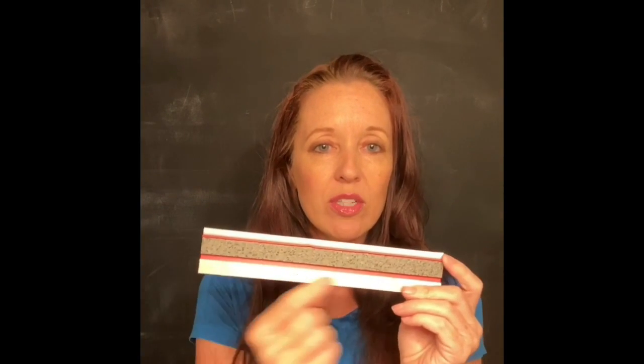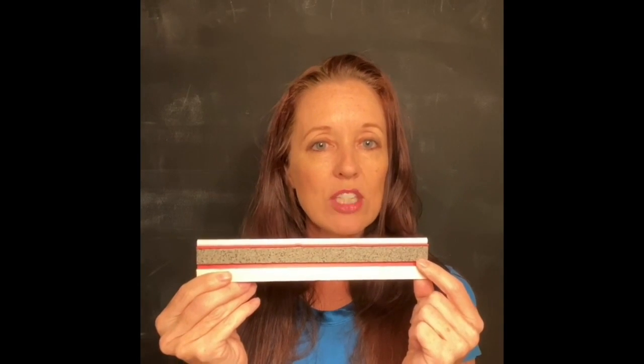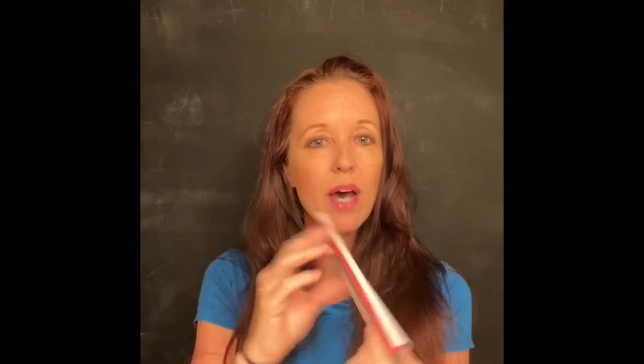in the United States. Then on the back side, you can see that there's this adhesive strip, and of course there's an intumescent strip that provides a prescribed dose of Firestop that will expand and fill the deflection gap if there's a fire. And it's all packed into the body of this fire gasket, which is this pink vinyl segment that will help prevent any damage to the Firestop when the drywall is installed.